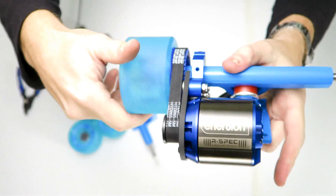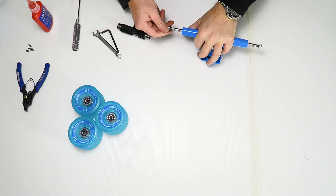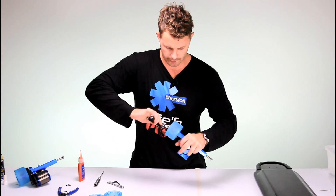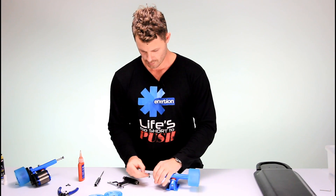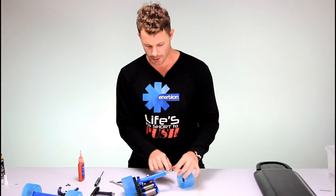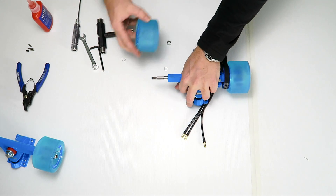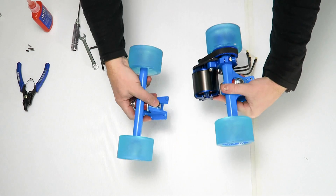Building a dual drive is just as easy except you'll have two 55mm length motors. Let's finish off with the mechanical stuff. Get the wheels put on — I've already got the bearings installed and there's a bearing spacer in there. Now let's put the driven wheel on here. Because this axle is slightly longer, you need to get another bearing spacer and put that on there — you actually don't need that washer. And that makes the alignment of the wheel correct. Crank that down. So now we have two wheels assembled.